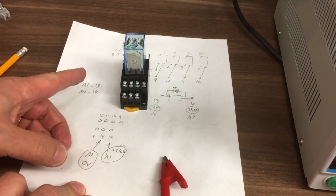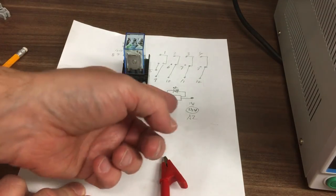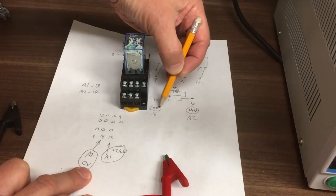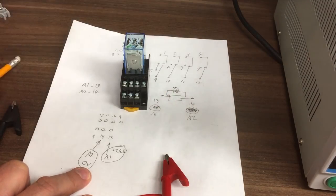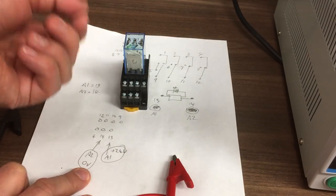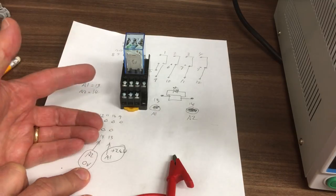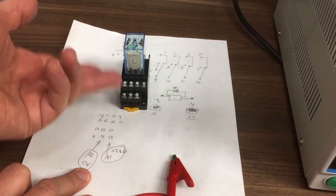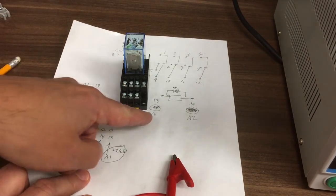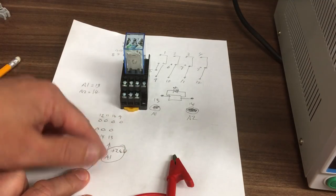So it appears if you wire it as per A1, A2, so positive in this end in A1, not like that, then you can get the LED to act as a flyback diode, and as you can see there's a little flicker of light, so it's absorbing that back EMF and saving it going to the rest of the circuitry. There's nothing else connected to these two, it just simply activates the coil or not, and I can't really see any issue if I run it in reverse, but as I say I've already seen that sometimes this is marked up as A1, which is the positive.